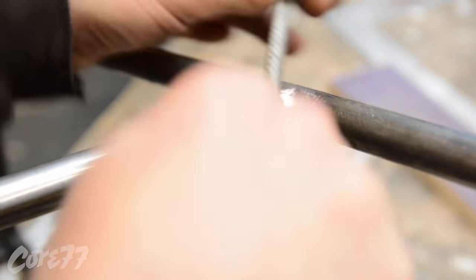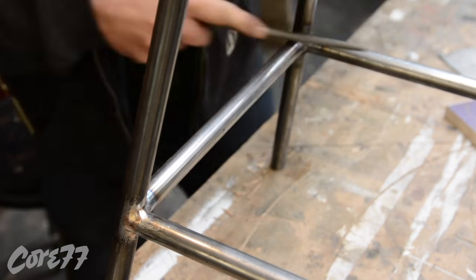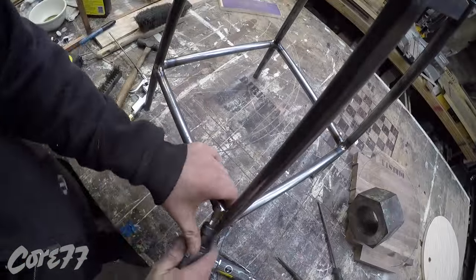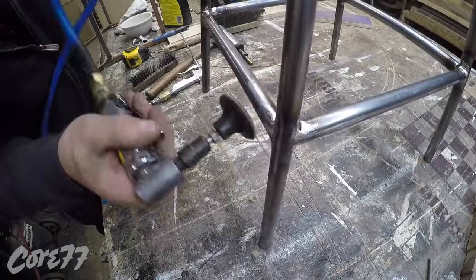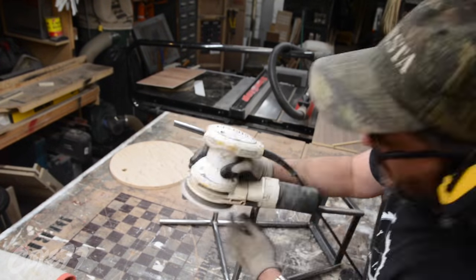And now I'm filing — this is just a regular rat tail file. I have a slim one and a chubby one, and I'm using both of them. I have more control with the file. You'll see I ultimately use a die grinder as well, but overall I got more done with the file. The die grinder was just to show some variety — here it is with a carbide burr on there. The carbide burr basically eats right through that silicone bronze weld, which is super soft. And now I'm just topping off the top of those tubes — the legs — just to make sure they're nice and flat once they go underneath the walnut seat.